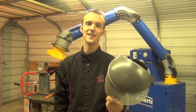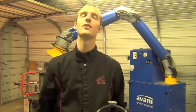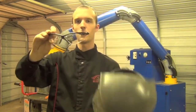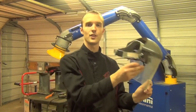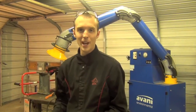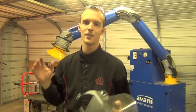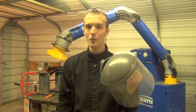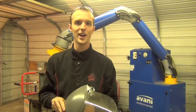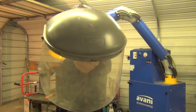Tip number 24: get a face shield. I highly recommend purchasing one because it offers infinitely more protection than safety glasses. Safety glasses protect a few square inches of your face; a face shield protects your entire face. Ideally, combine both when grinding — I've seen pictures of what happens when grinding wheels fly apart and they embed in people's faces. I've personally had a piece of metal in my eye, which I wouldn't have had if I'd been wearing a face shield. This is a Fiber-Metal brand face shield — about $30-$40 online, I've had it a couple of years, and I wish I'd had it since I first started welding.